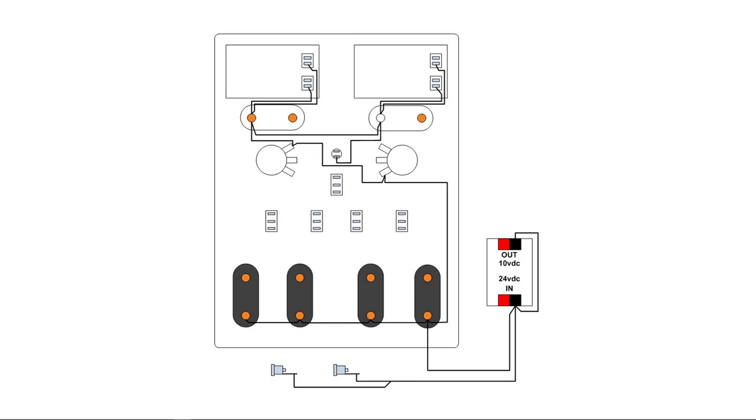The black wire needs to be on the bottom lug on the right potentiometer and the top lug on the left. Then it goes up to the negative terminal on the binding post under the display. These displays can be three-wire or four-wire. Each four-wire display has two connectors — one for power and one for the voltage you're measuring. Three-wire displays share the common wire. Either way, all the negative sides of the devices connect together into one common connection.